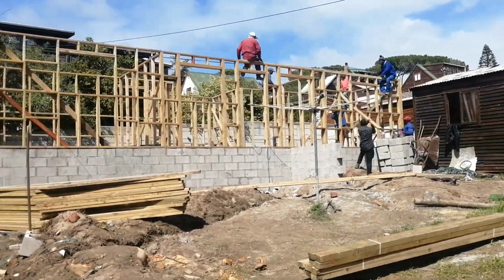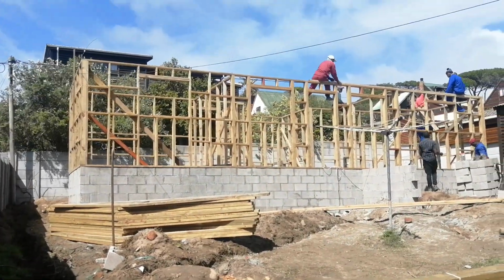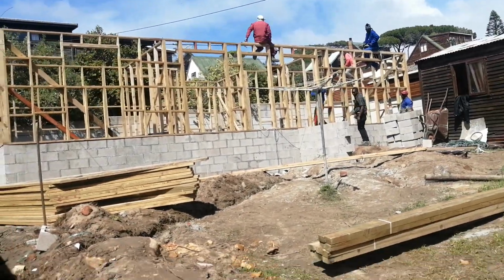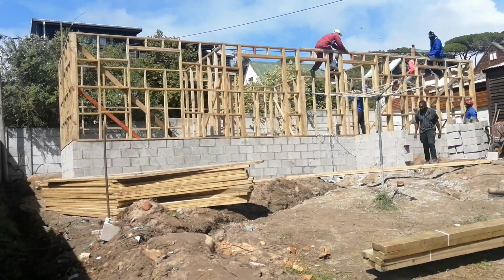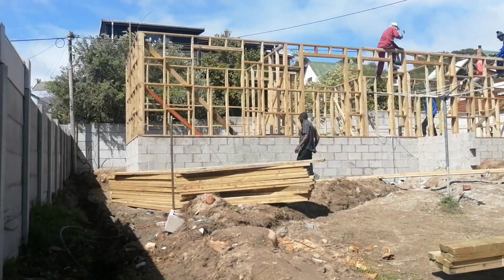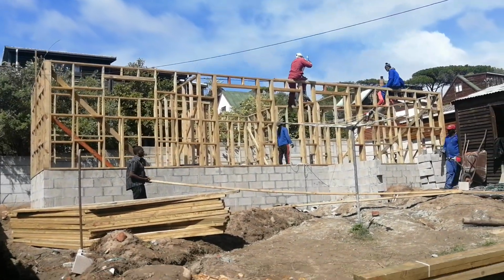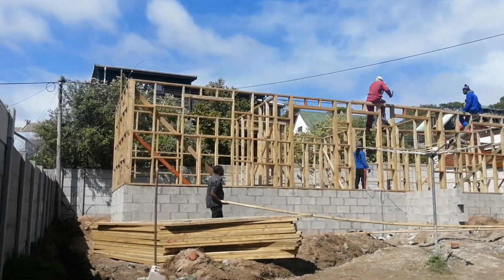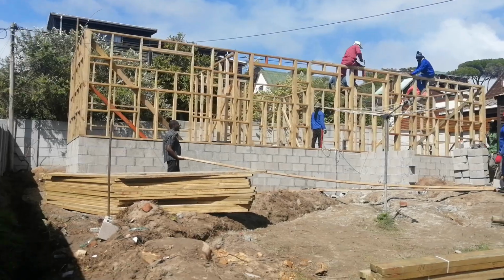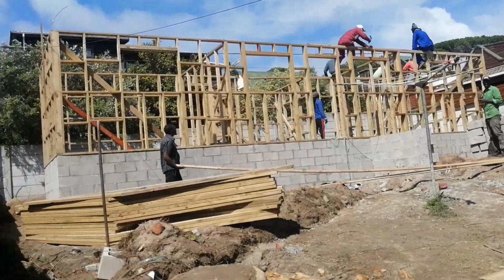We use South African Bureau of Standards approved timber and aggregates. By the aggregates, we mean the stone, the blocks, the sand. All these aggregates are approved by the South African Bureau of Standards, SABS. For the SABS timber, we use the right thickness of timber, 114 by 38. We also have 152s, the beams for the roof, because we have to make the roof very solid.